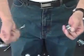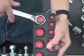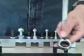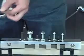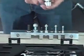Now here are the features of this new system. The go-through capstop wrenches have all the same functions of a reverse gear wrench, so it can handle all the same applications. Go-through capstop wrenches can also be used with an adapter for use with traditional sockets. But when looking at the same fastener problems as before, we see that the problem of the long bolt can be easily overcome with the use of a go-through socket, no matter the length of the bolt.